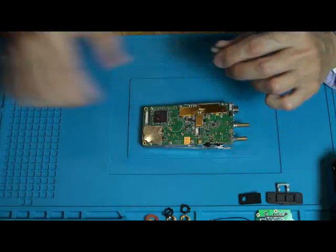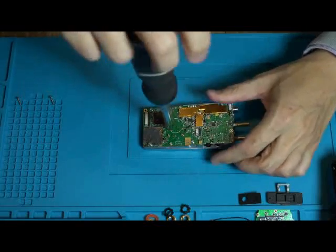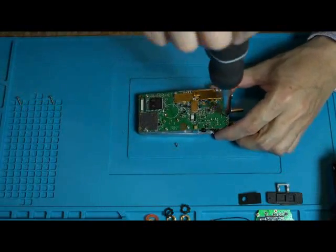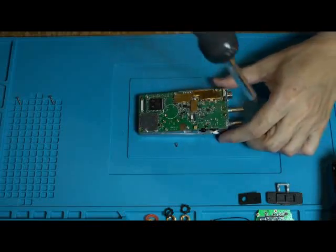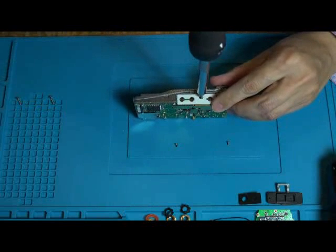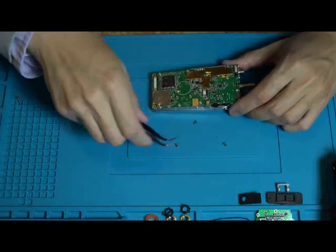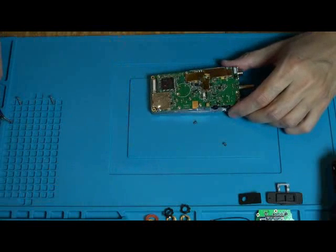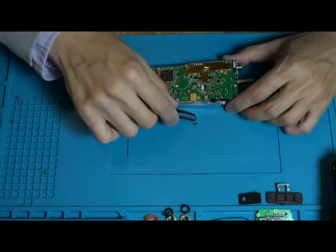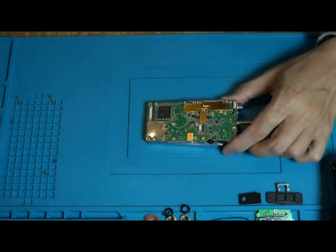The next step is to remove the screws that hold the PCB to the metal case. The screws he's going to take off first are the countersink screws — there's three of them: one down in the middle, one at the top, and one on the side of the radio holding the microphone push-to-talk and PF1/PF2 buttons. Those are three countersunk screws, so make sure you keep those separate. This guy's got a great workbench where he can put the screws and remember them.